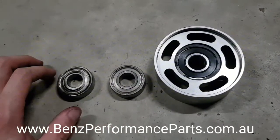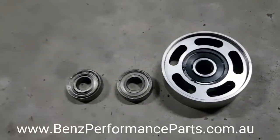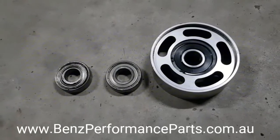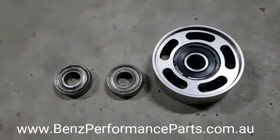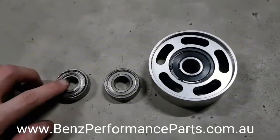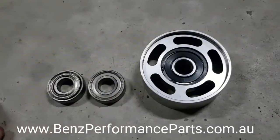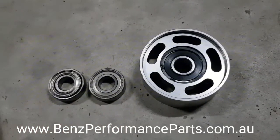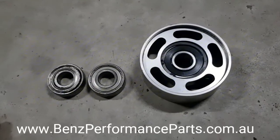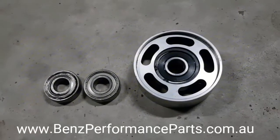But what happens is because it doesn't actually have a seal, your oil gets out or water gets in. So you wash your engine down and then all of a sudden your bearings scream their head off. These type of bearings really shouldn't be used in an area where they can get wet. Their applications are inside cases or something that's lubricated with oil or grease.